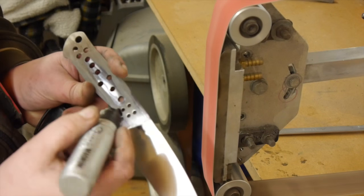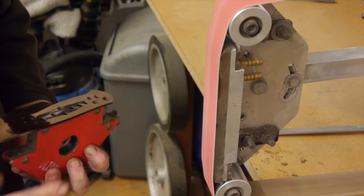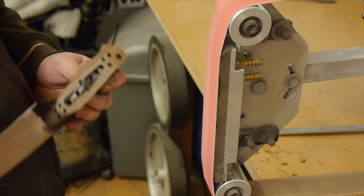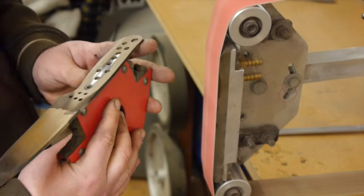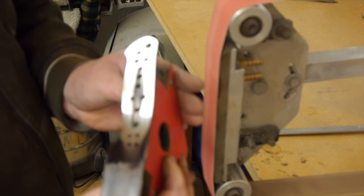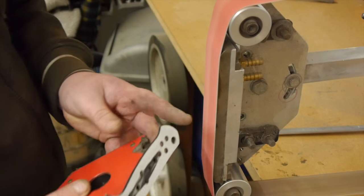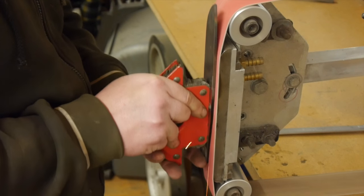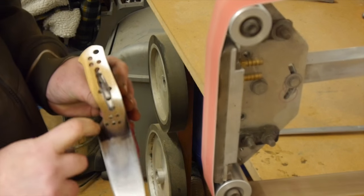Pen on here to the front. Move the knife down a little. Use my finger at the bottom so I can feel some heat. Nearly there now, look. Obviously as this gets thinner, I want to be able to feel the heat. That's telling me now I need to just keep walking it. You're nearly there now.